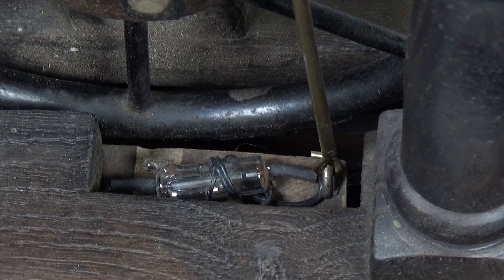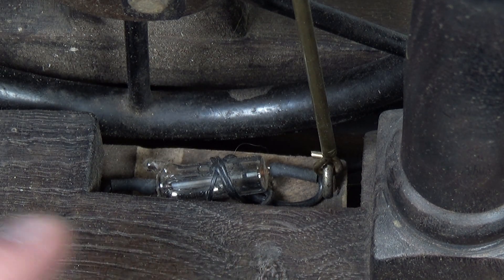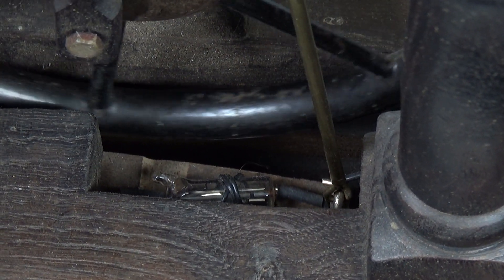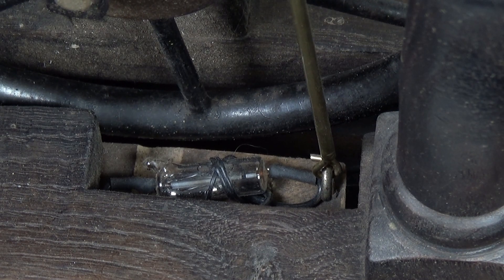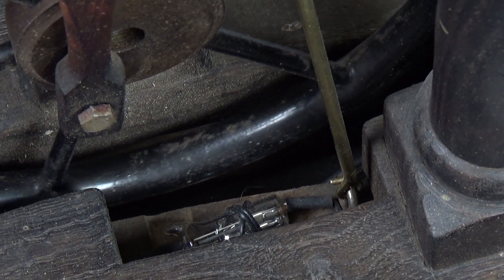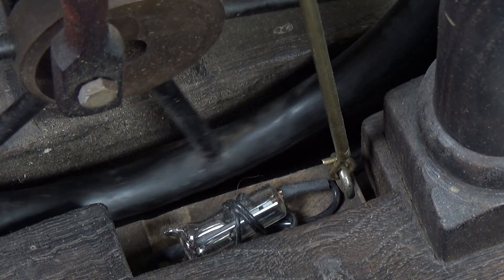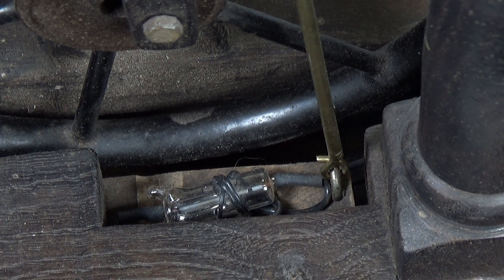This has got a very interesting system. I don't know how well that's going to come out on the camera, but that glass bulb is actually a mercury switch on a little tilting table. As the beam goes up and down, the table drops and lowers, and the mercury bead goes from one end of the tube to the other. At one end of the tube are two contacts which the mercury shorts out when the thing is running — a very unusual system.